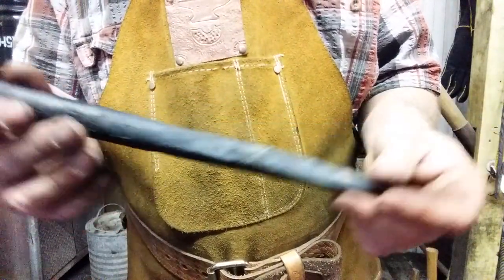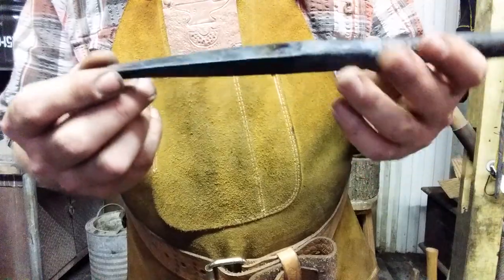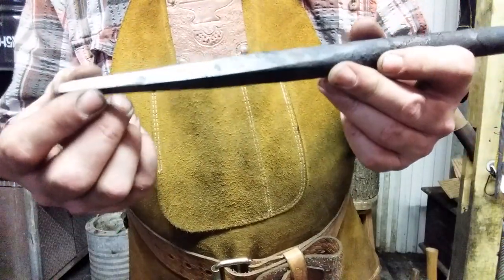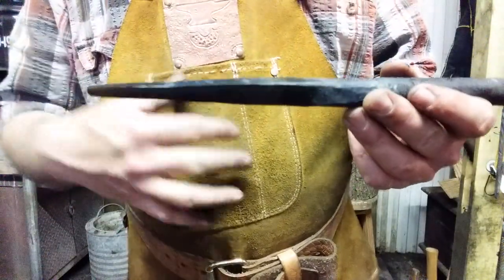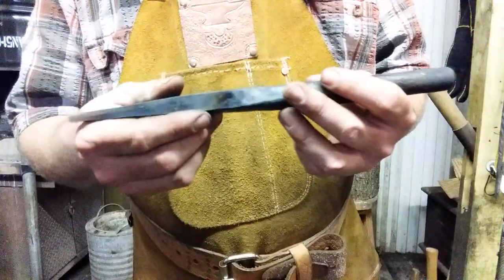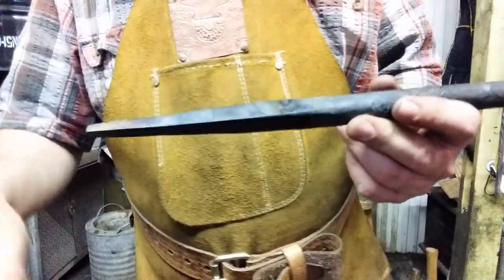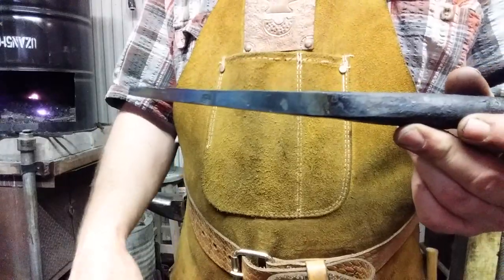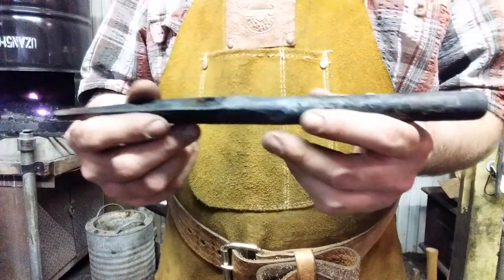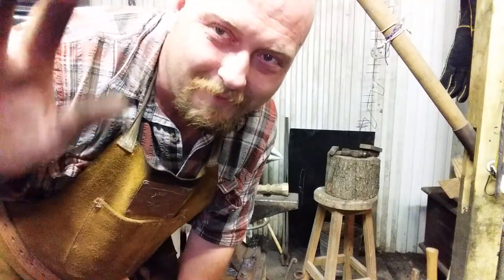There you go — there's how to take a piece of hardened steel and create yourself a square punch you can drift holes out larger with. I suggest working both sides of the hole and punching the slug out back and forth, then you can widen the hole. To me it doesn't matter a whole lot if it's tapered to one side or another as long as the fastener works. You can create one that stops at the desired size and then tapers back the other way as a drift you can drive completely through and make a square hole that's square both directions. But anyway, that's what I've got for tonight. I hope you enjoyed it, hope you gleaned something from it. Till next time, bye.